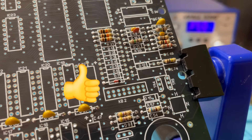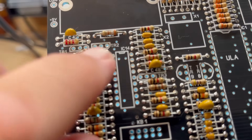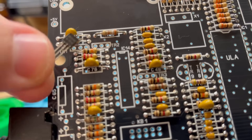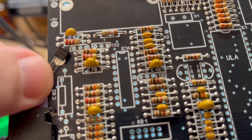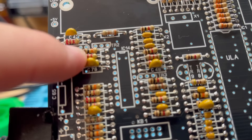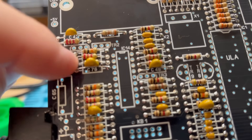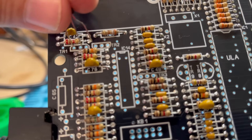I haven't got a D16 either — doh! Next up it's the transistors, and it's important to note that TR1 and TR2 are actually printed on the PCB in the wrong orientation. TR1 should be placed flat side north and TR2 should be placed flat side south.